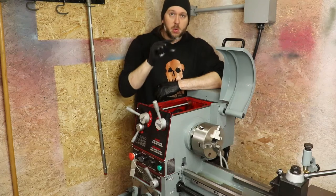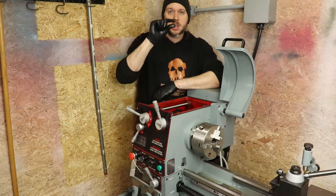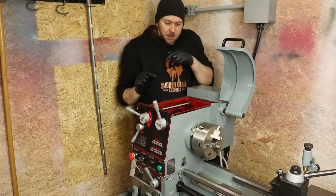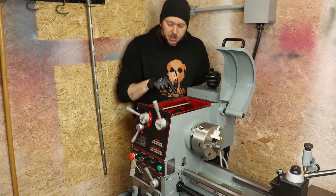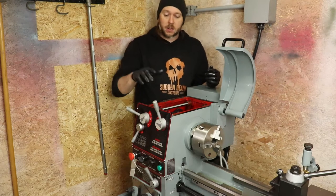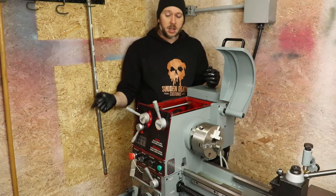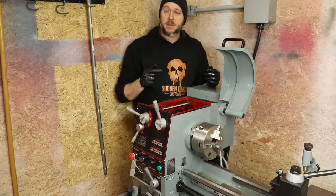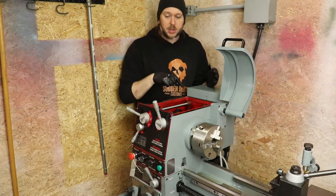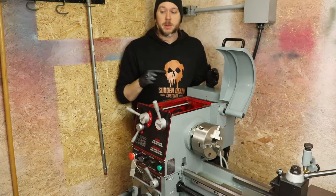So when we get ready to do the ways, I'll get a bit of that and I'll show you between my fingers how it'll kind of give you little spidey webs when you squish your fingers together with it. So in the meantime, we're gonna dump 2.5 liters of oil down the top of this. I'm not gonna bother putting the head cover on yet because I don't wanna do that through a funnel, it'll take all day. It's just, you know, half of that 5 liter jug that I picked up gets dumped in here and we're good to go. Put the top back on, put in our 6 bolts, and we're ready to clean up the rest of the machine. So let's put some oil in this baby.